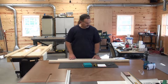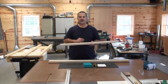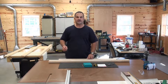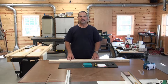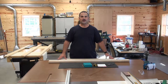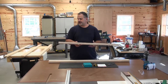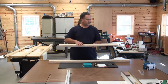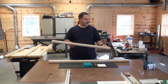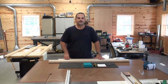Now I have both boards all sanded down. I used 220 grit sandpaper. I took measurements off my wall where I want to mount these so that I get the right placement where the 2x6s are, so that it's actually screwed into the strongest part of the wall. I took those measurements and put them onto the two boards, drilled and did a small countersink, and I think we're ready to get these installed onto the wall.